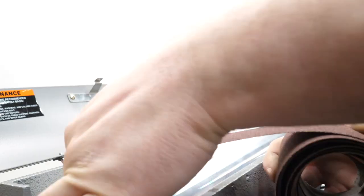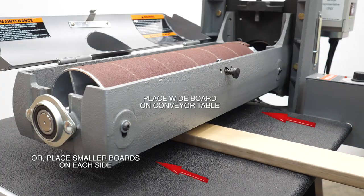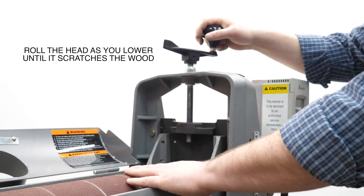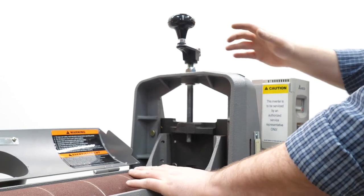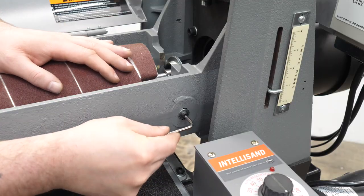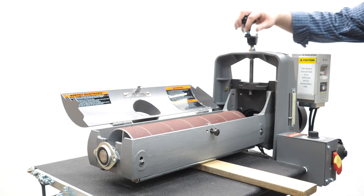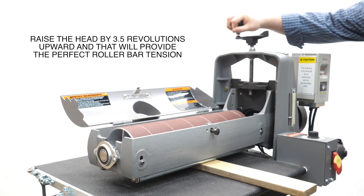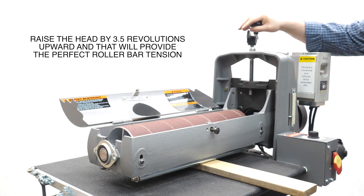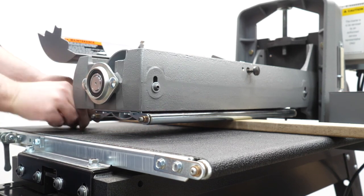Remove those boards and reinstall the paper onto the drum head. Put one board back underneath the head, then lower the sanding head until it just touches the board — moving it back and forth, you'll hear it scratch slightly, and then you're good. Release the roller tension bars from the raised position and let them drop down on top of the board. Finally, raise the head by three and a half revolutions upward — this lets the roller tension bars drop down slightly. Tighten up the roller bars and they'll have the perfect tension to hold boards down as they move through the conveyor table.